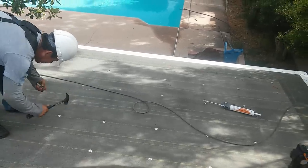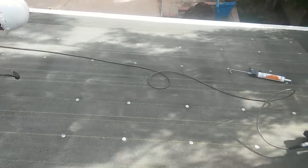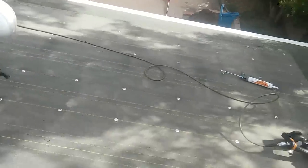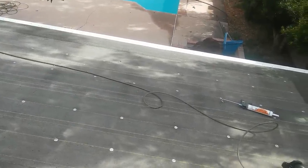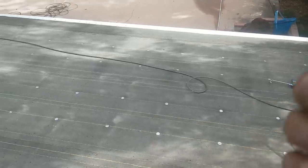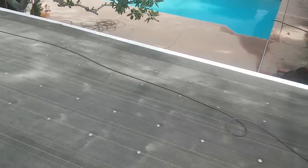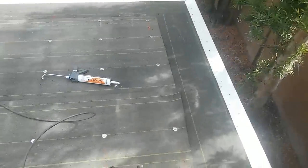I drew chalk lines that run across the beams, because what I'm trying to do is nail on the rafter, and prevent the nail from going through the one inch wood, so you can't see the shiners on the outside. Even if you paint them, with time they get rusted, and you're always going to see them. So I'm doing this to prevent that.